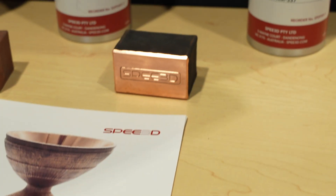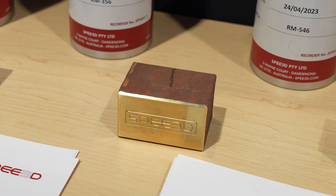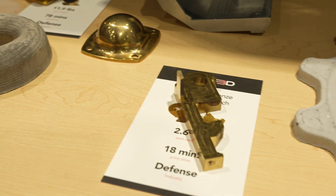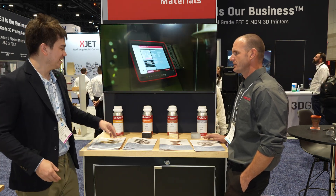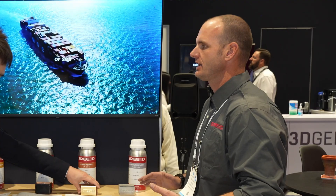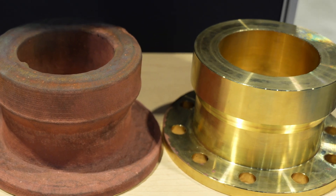This aluminum bronze is actually an alloy — a blend between copper and aluminum powder. Could you mix aluminum and copper powder together and it turns into bronze when deposited? That's exactly what's happening. We call it a compositional alloy, where we're combining dissimilar metals in the powder. When they spray, they mix and fuse together and produce a completely new alloy.